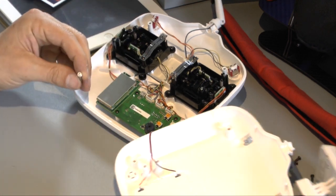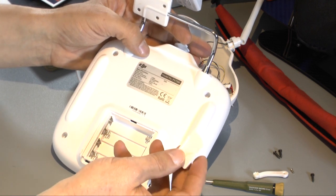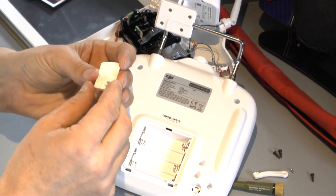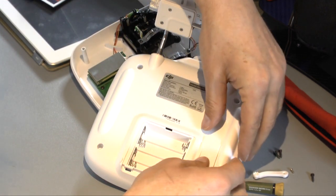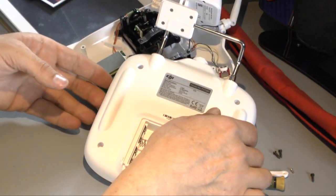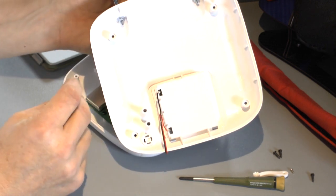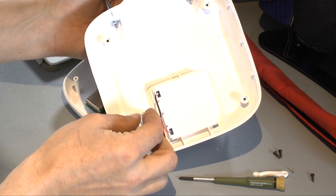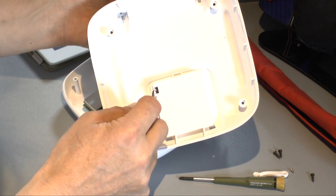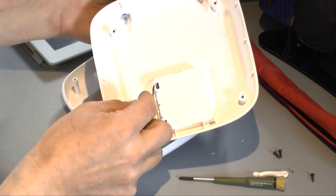Okay, first of all, we have to put this small cover, or what else? It's a holder. You have to put the holder here on the back side. There's glue on it. Remove this one and put it here in the hole. It's very easy to mount. Press it a little bit together, and it's perfect. That's it. Next point is put the stick into the hole, and that's what I said before. Take care that the cross on the stick has the same direction as the cross on the potentiometer, because then it's much easier to mount this together. So I turn it a little bit in the right direction. And no, it's not perfect.